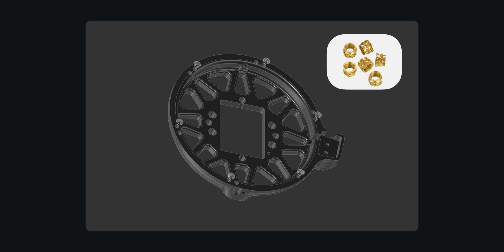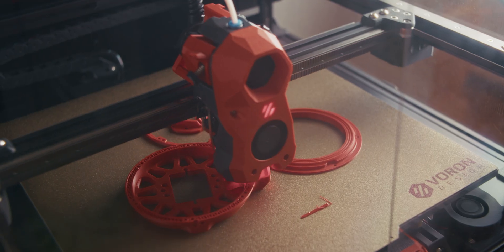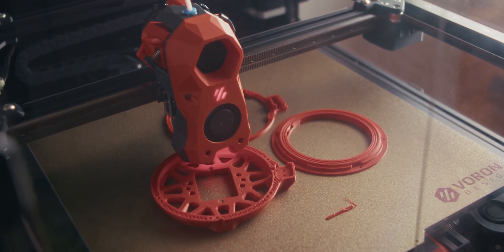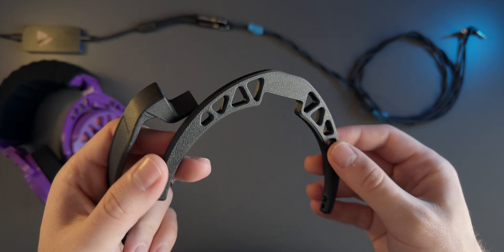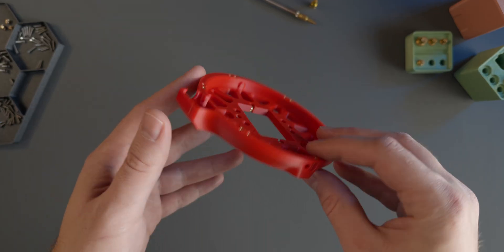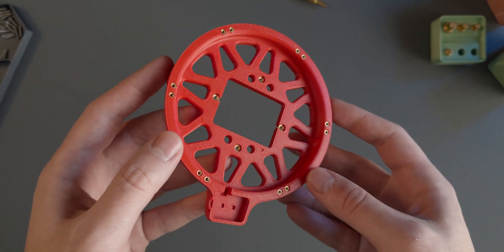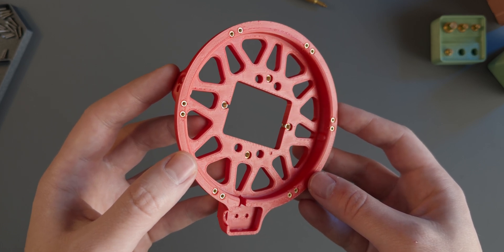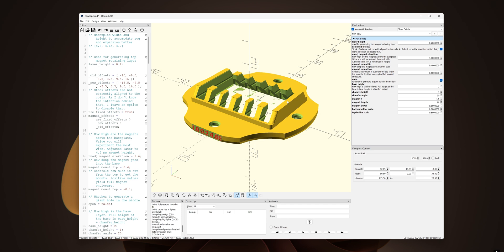No more self-tapping plastic screws. Then I fired up my Voron 3D printer and printed all the headband parts in PETG carbon fiber for a matte black high quality finish and all the driver parts in red ASA filament to serve as the accent color. Next up I replaced the magnet holders with a mod by GitHub user cab404 that optimizes volume output by placing the magnet array closer to the driver flex boards.